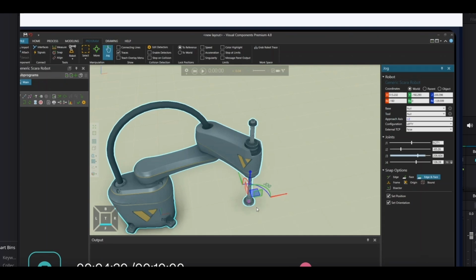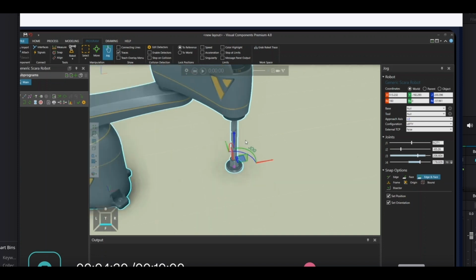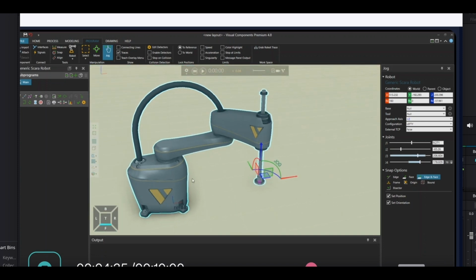And you can kind of see the mechanism and how that's going to rotate around there with this little kind of helix that goes around there. And so this is a four-axis arm. And the idea of forward kinematics right now is, you see what I have with this arm is that I have a location here in space. And we can read out that location in space. There's an X, Y, Z location.